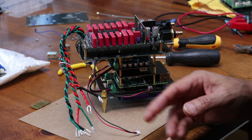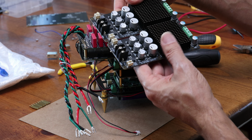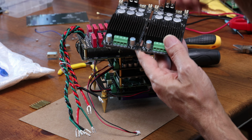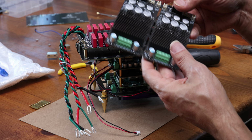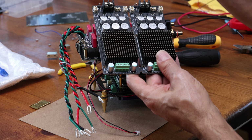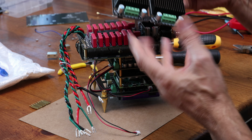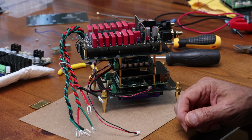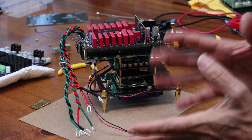And then for the plus 5 and the minus 5, maybe you can have a 2 linear supplies like this, and you supply them with a transformer, some AC here, and they come out from here. From here you have the option to put UC Pures, UcConditioners on top or not, depending on your level of safety that you want to go for. But this will probably be intermediate because there is still some wiring to do with the high voltage, like the 120, you have a transformer and all that kind of stuff. And a step above that, you can use 2 UC Pure with the 2 big ultra capacitors. You've got to be very careful with those, so do that at your own risk because that could be dangerous. But it is the best power supply.